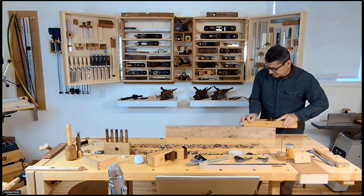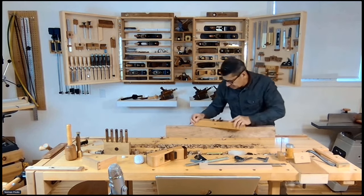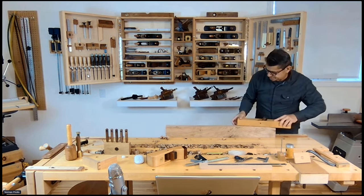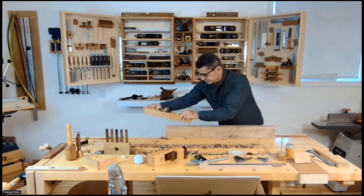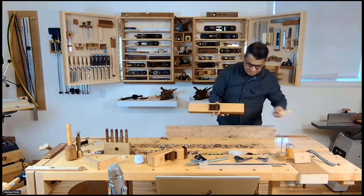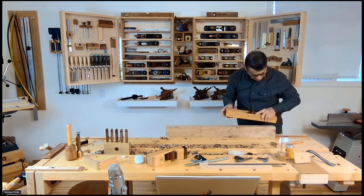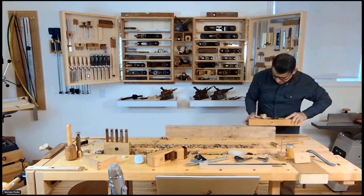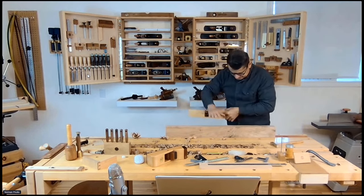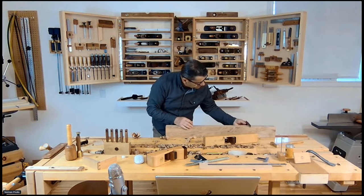Let's try this one. Ideally, the width of the blade is at least the width of the edge. I need to back off — the shavings are a bit too thick. This is how you do it using a plane hammer; that retracts the blade. That's better. I periodically test for square using one of the reference surfaces.